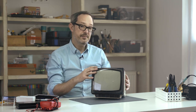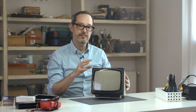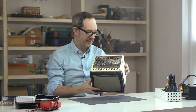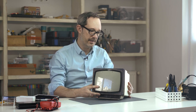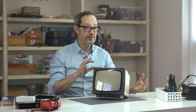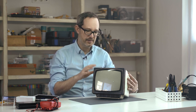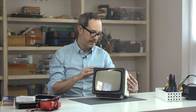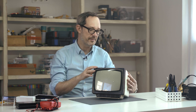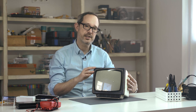First order of business is to clean this up. It's kind of like when you wash your car and it feels like the car actually runs better because it's clean. Maybe I'm a little superstitious, but I think we need to give it a quick wipe down. Then the strategy is to open it up, see if there's anything wrong, fix that, and then introduce some power using a Variac and possibly a dim bulb tester that I built for this project. For now, let's give it a quick inspection.